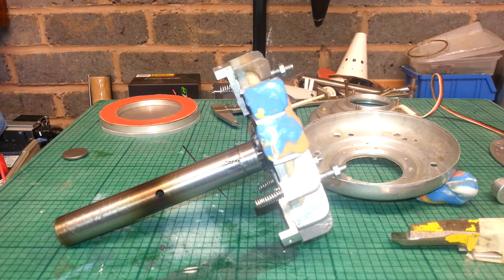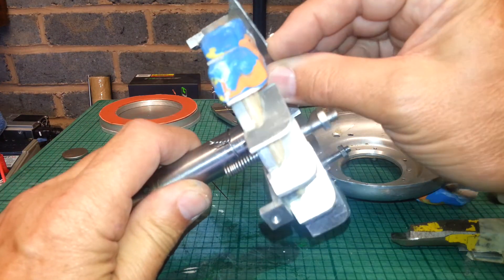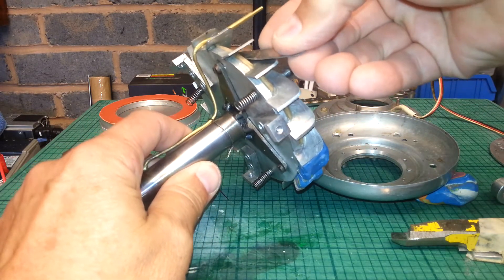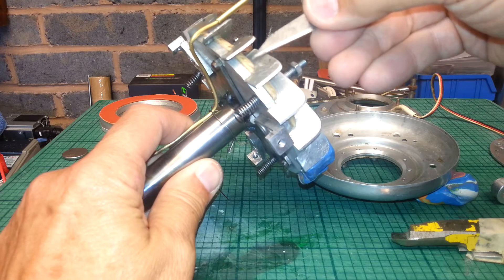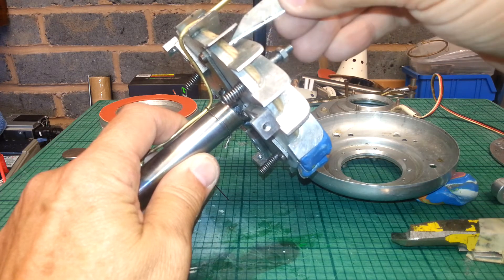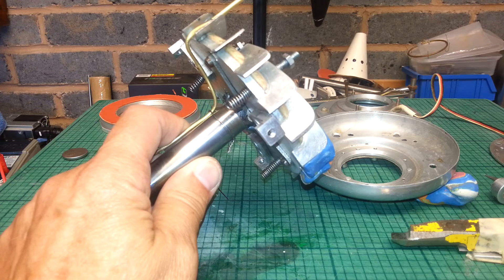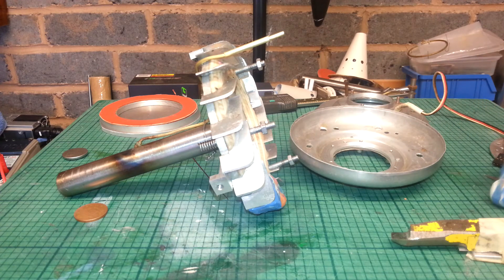So I think that's about it. This diffuser — you've got to make sure you get some radius gauges. It looks like the radius is too far back; put a five milli line in with a pen before you start doing it, or stick the blades in to show where to go to. Even mark four milli, and then just wait till the four milli mark has just disappeared. I think that's about it, just a quick tip. Alright, bye for now.